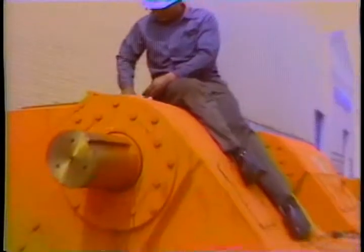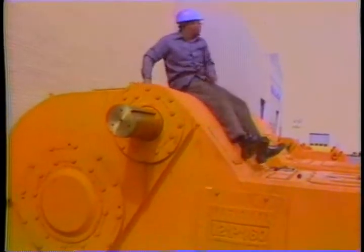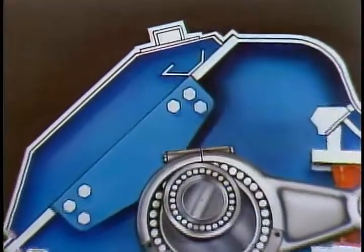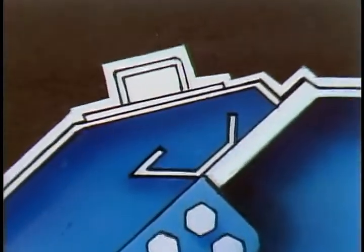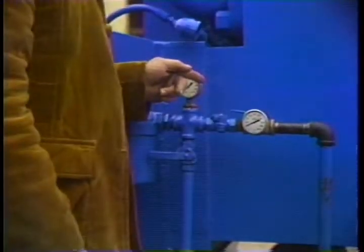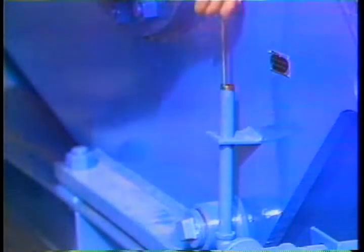Clean and change filters and refill the crankcase with a proper lubricant. If your pump is not equipped with an external oil pump, take special care to pour some lubricant into the distributing troughs at the top of the power end near the pinion shaft. For a pump which does have an external lube system, you should still fill the crankcase cover oil trough. Start the oil pump before the main pump. Make sure the oil temperature is okay. After running the main pump a few minutes, shut it down and check the oil level and add or drain as necessary.